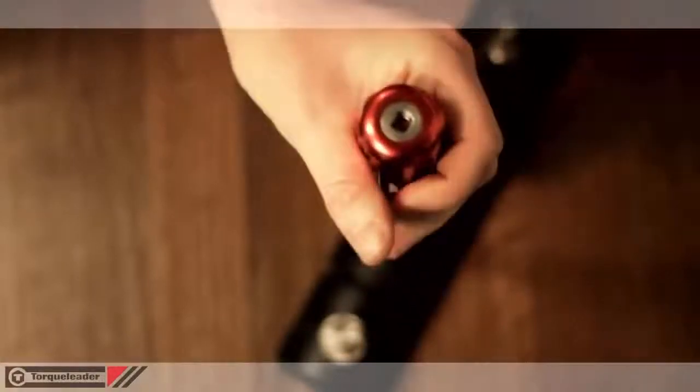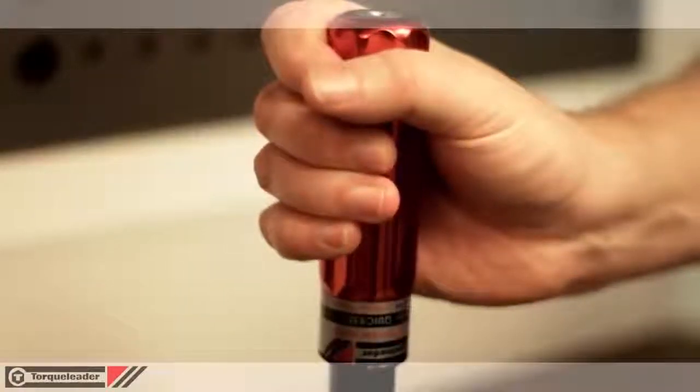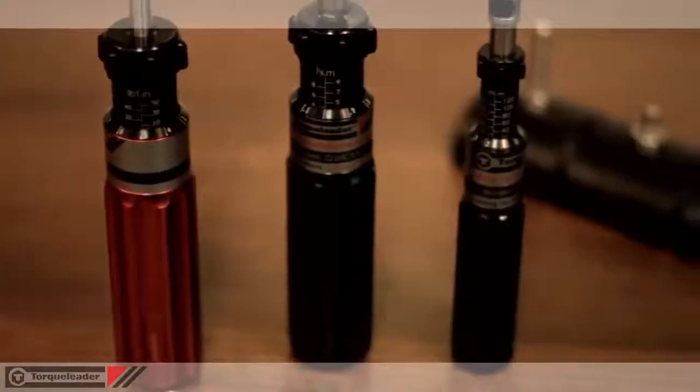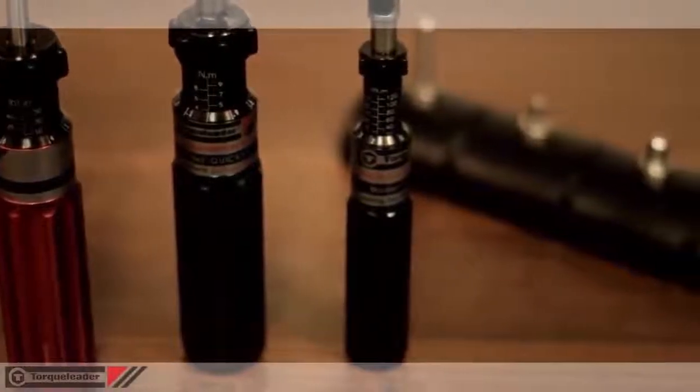At low torques, the risk of over-tightening the fastener is increased. The Quickset screwdriver eliminates this risk by slipping free at the set torque, making it impossible for the operator to apply more than the chosen value. There are 6 low shock resets per revolution, minimizing operator fatigue.